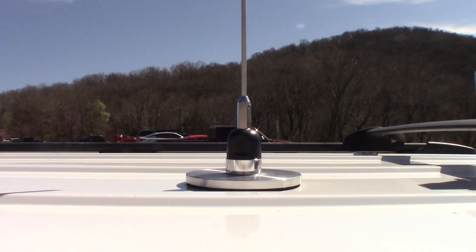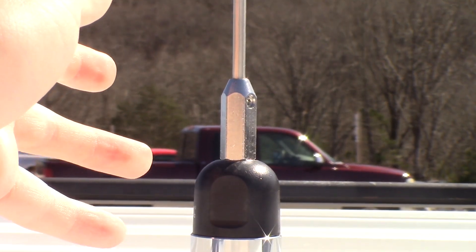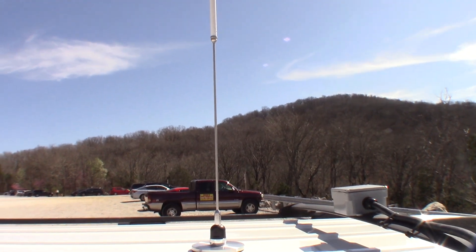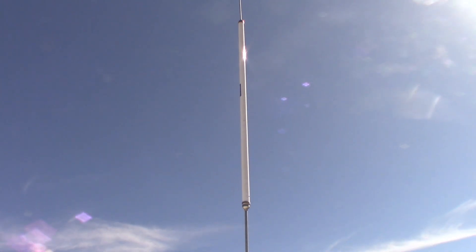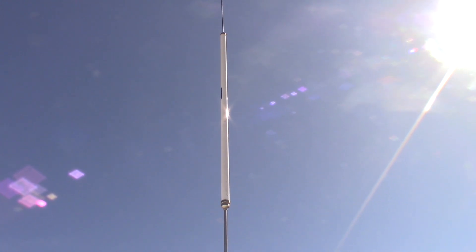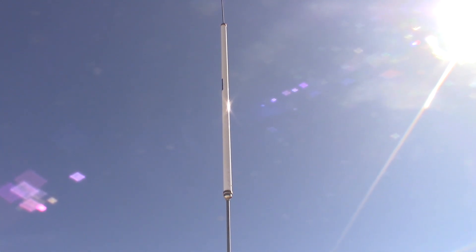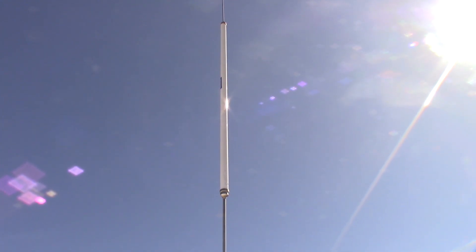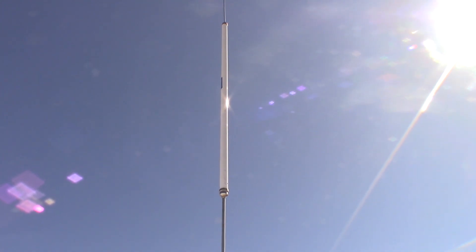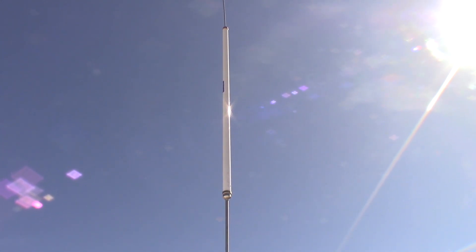We have a 3/8 mount here with a little set screw, and you can move it up and down to tune it when you're setting it up for the first time. From there we have the first rod which goes up about 20 to 24 inches, and then from there we go to the phasing coil. This is a very thin coil — it's kind of disappointing how small they made it, because the power handling is only 200 watts on sideband and 100 watts on FM. For how well-performing this antenna is on receive and transmit, I really wish they'd built it with more power handling in mind.